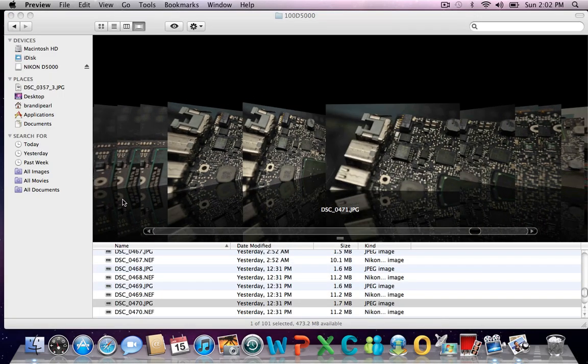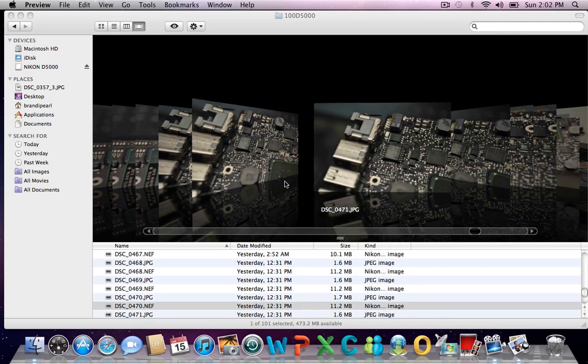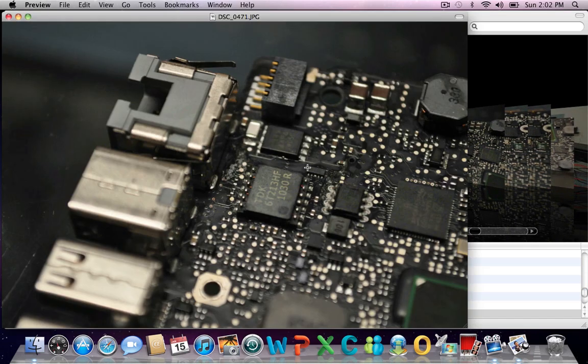Let's see if we have any better stills of this unit. That appears to be a little bit better. See how the pads are squared off? When you have squared off pads, that's a pretty good sign you have proper solder flow. Right here we have rounded pads, which means you probably have corrosion going on. And then of course you have this — looks like corrosion over here as well.